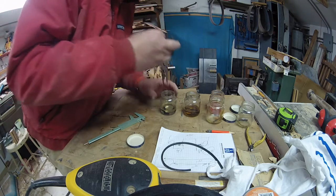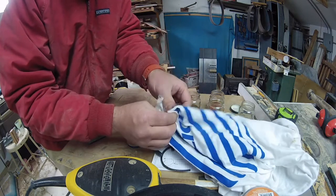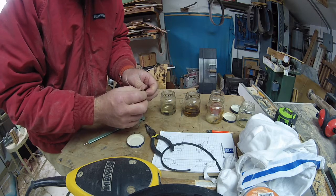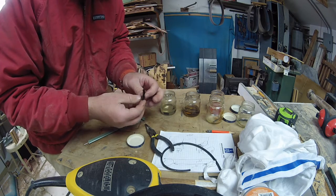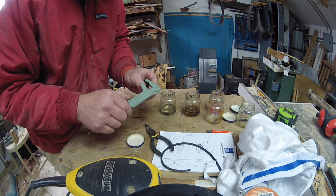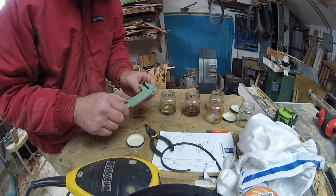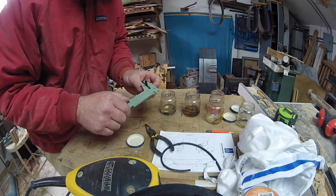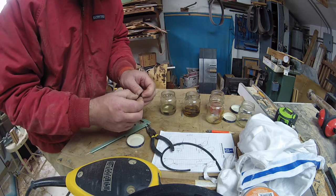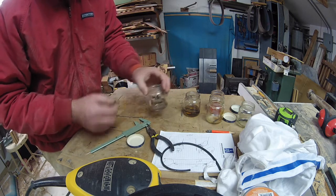This one is mineral spirits. A couple of differences I can feel immediately — it is fatter and softer. It is far more flexible, and pulling on it shows it's also far more brittle; it stretches and breaks. Five and a half, maybe six millimeters depending on where I grab it. This just feels gummy. I suppose that makes sense soaking eight months in a solvent.